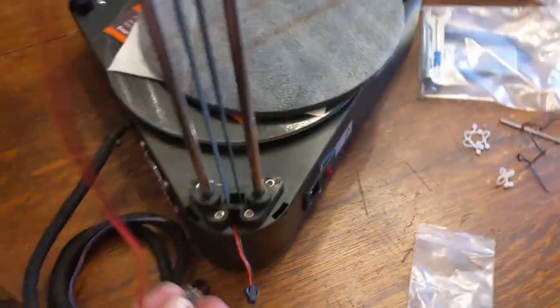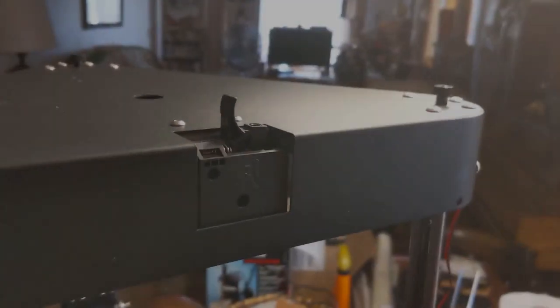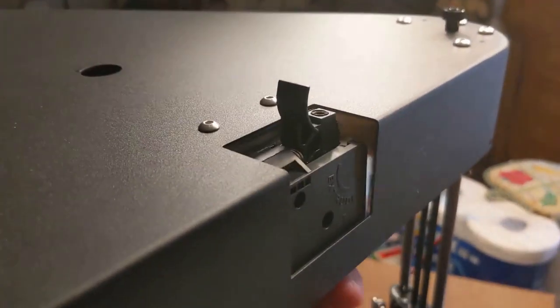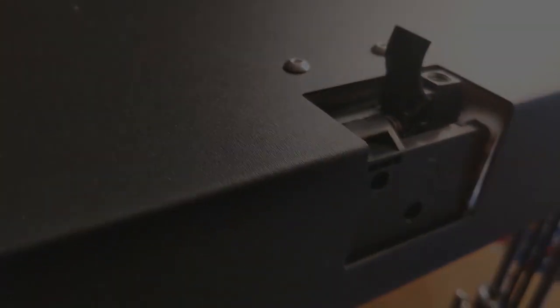The end stops — three of them — are all in the top of the printer. They go down and plug in below. The extruder can only mount one way; if you try to mount it another way, you'll have no luck at all. It says it's a Titan extruder, and according to what I've heard from other people, that's what it is. Got the flip lever, comes up through a hole. Two screws mount to the bracket on the extruder. You plug the PTFE tube into the extruder going down to the hot end, and the wire is a multi-pin connector that mounts through the top.